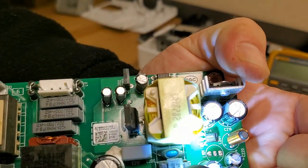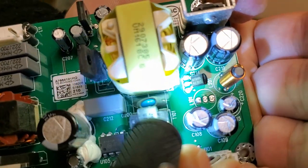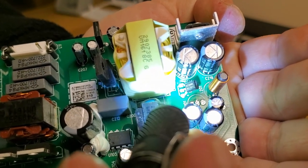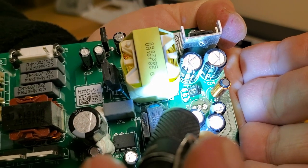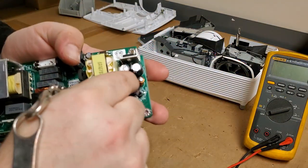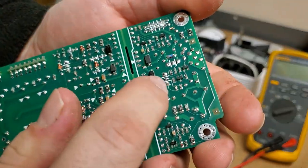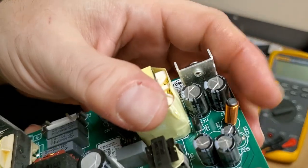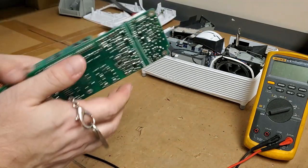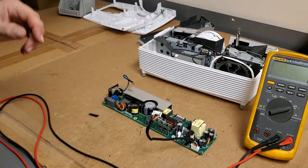See, that is a B, let's see, BT169DL. It's like BT169DL. I don't know what that is, but it's on the low voltage side. It goes to all these transistors, so that's probably a voltage regulator of some sort. But all that stuff was working, so you know, we have our low voltage. Just aren't getting high voltage all the time.